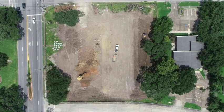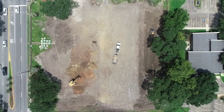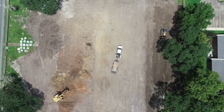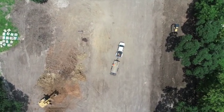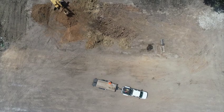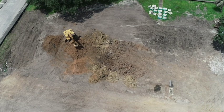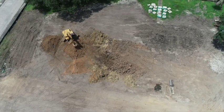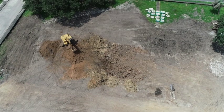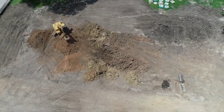See the truck and trailer there. Used to be a house here, as I told you earlier in the video — we tore the house down, hauled it all off, salvaged some rock. We passed our proof rolling yesterday, so today we're mixing dirt. We got dirt on the job that was here before the rain — it got pretty wet. We're moving it around, drying it out. Still paying for the rain. We're bringing in dry dirt, mixing it with it, so we'll work with it and get it down to where we can get it in the slab and it'll pass all its inspections.